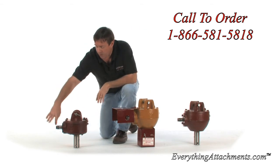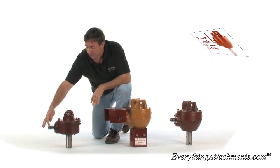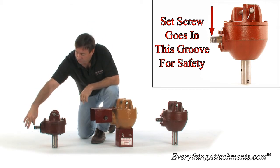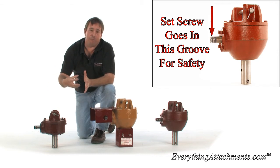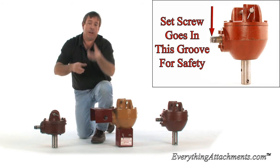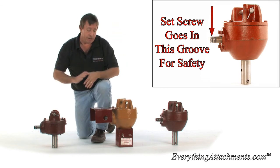The way these work is the shear bolt for your drive shaft goes through right here in this hole, and then there is a groove cut right here. You want to always make sure that if you've got a true post hole digger drive shaft, it will always have a set screw that screws down into that groove. So if you hit something in the ground and shear that bolt, it keeps that shaft from moving forwards or backwards — and especially from coming off — because if your tractor were turning that shaft fast and the shaft comes off instead of staying up on the box where it's supposed to be, it could be flopping around, and that would be a bad deal.